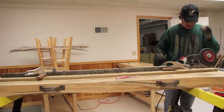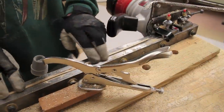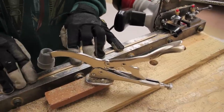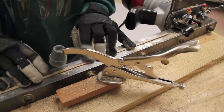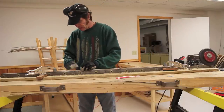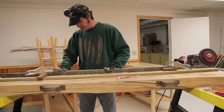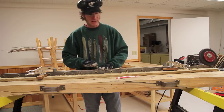Next I'd like to show you how this tool works — this tool that I invented for rough cutting my cane. I have this planing form, and I clamp my pieces into the metal planing form. My form is actually set to the taper of the rod that I'm trying to produce. The V that's notched into the form can be adjusted and it tapers down, so that when I go into the hand planing process I already have that taper. Basically I'm just taking long curls of bamboo off, which makes for quick work and an accurate fly rod.